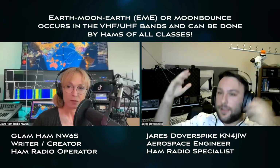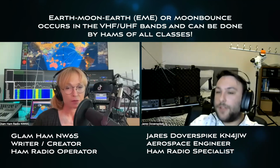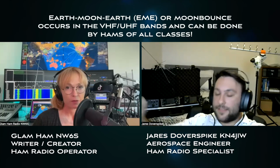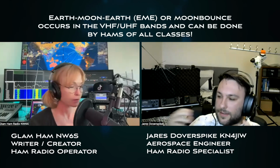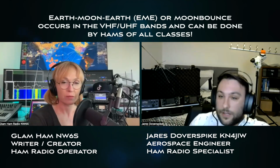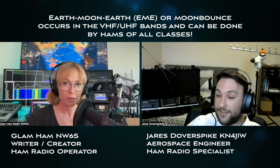It's the moon, so it's very accessible and able to do different studies on. People have done sweeps and done the data collection necessary to provide your decibel attenuation on reflecting off the surface of the moon, in addition to your free space loss. So all this data is out there for people to take a look at and see if their equipment is able to do it, and in addition, what size of antenna gain you would have to have in order to have the other person receive it.